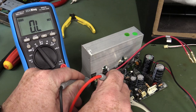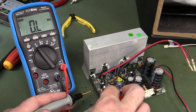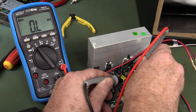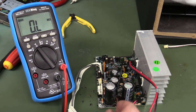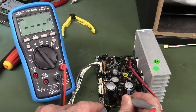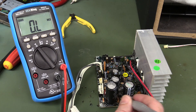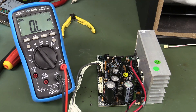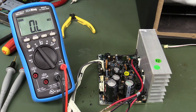Let's measure our gunk — this meter goes up to 50 meg. That one's actually not too shabby, maybe in a drier environment it hasn't picked up nearly as much moisture. But this one around the woofer area — there you go, that's actually the worst we've seen. No wonder the woofer is not working. And probably why that resistor burned out, though I'm still not sure. Still a problem — caps and black gunk. Unbelievable.